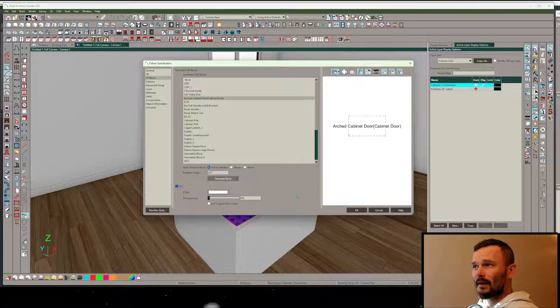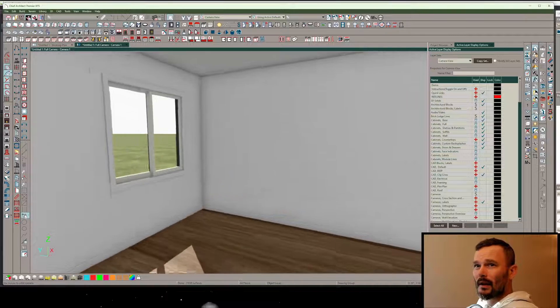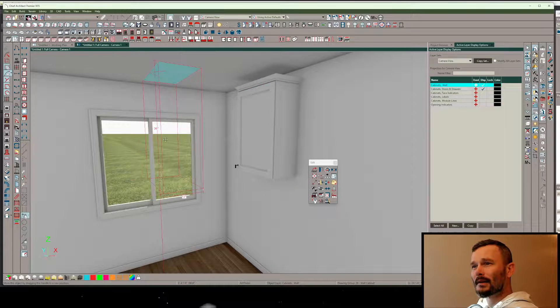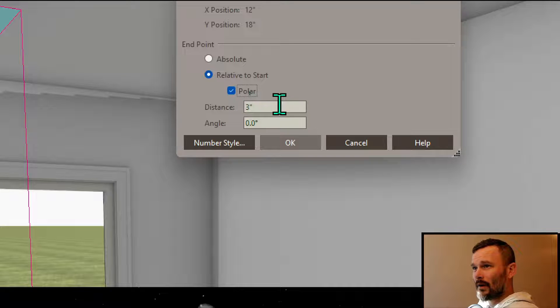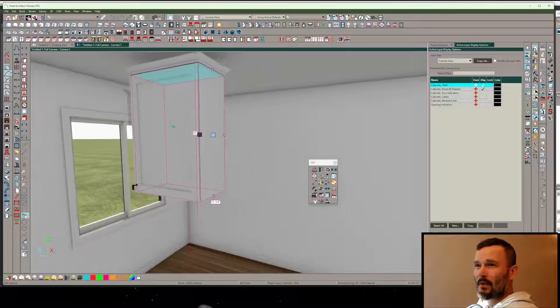The last thing we need to do is get to that 2D block - let's regenerate it to get an appropriate block and press OK. Now I'm going to place a wall cabinet and bring it off the wall - it's a little easier to deal with off the wall. I'll check Polar at 1.25 to make this 13.25 overall depth.